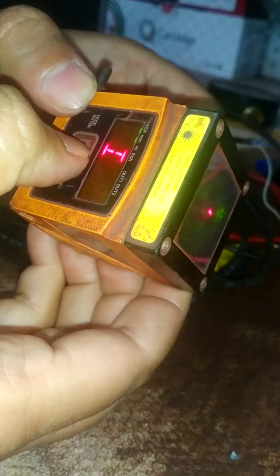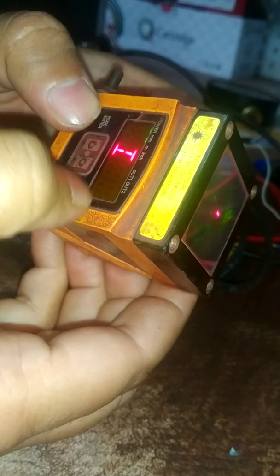Next we go to OU2. In OU2 we have set it to current. I can also show you how to change it — press the set button and you can see the 'I' is blinking for current. After some time it shows 'U' which means voltage. Let it remain in current feedback. Don't forget to press the mode or enter button to save whatever changes have been made.